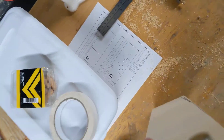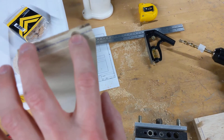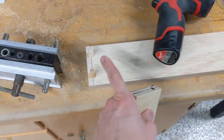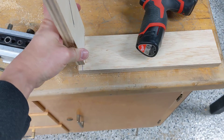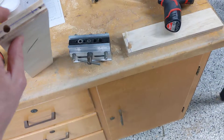There are a couple other tricks to try and get stuff lined up. For example, you could drill your holes in the first board first, put the pegs in, and put a little dab of glue on the top of each one. Get the second board lined up — boom — and then that can tell you where you're going to drill the second set of holes.